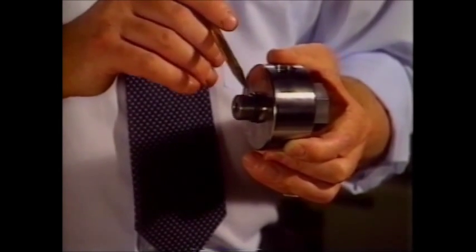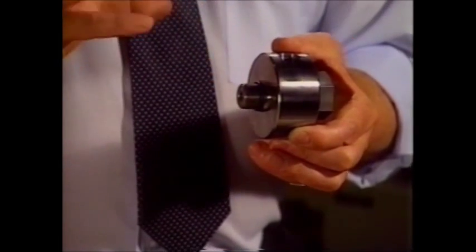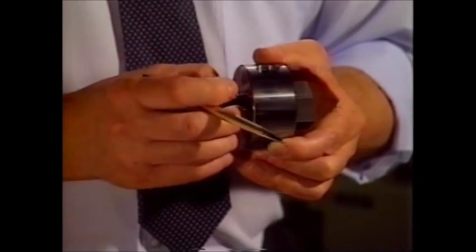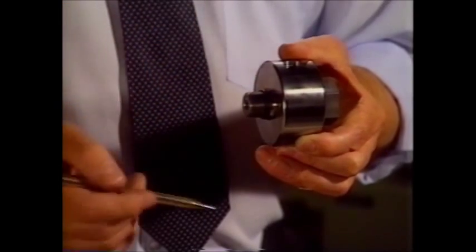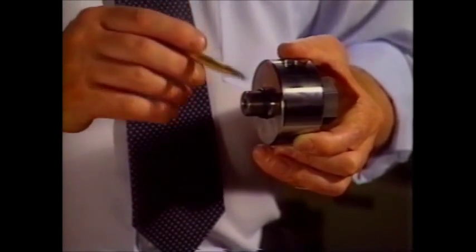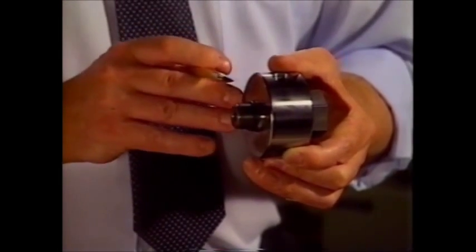When this is assembled into the port, the angle of the taper of the port creates a compression fitting environment, forcing this down into contact with that raised portion on the bolt, and creating — without O-rings — a leak-free interface.